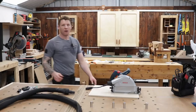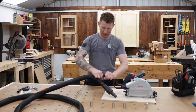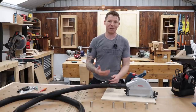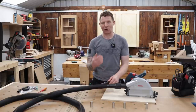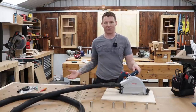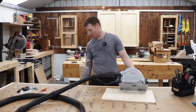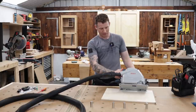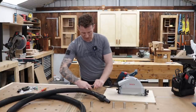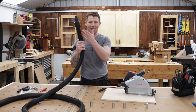That's the Neutrik PowerCon TRUE1 connector - a nice quick couple. Now it's just a case of grabbing your combined dust extraction and power lead, plugging in, and you're ready to go on any of your tools. It's a nice robust connection with a quick release quarter turn. I have a wireless system controlling my dust extraction, so when the dust extractor comes on it sends power to this lead. Right now there's no power at the track saw - if I hit on the dust extraction, the track saw powers up. Then just pull out and quarter turn to put it away, and the same setup works for a sander, router, spindle sander - power and dust extraction all in one.